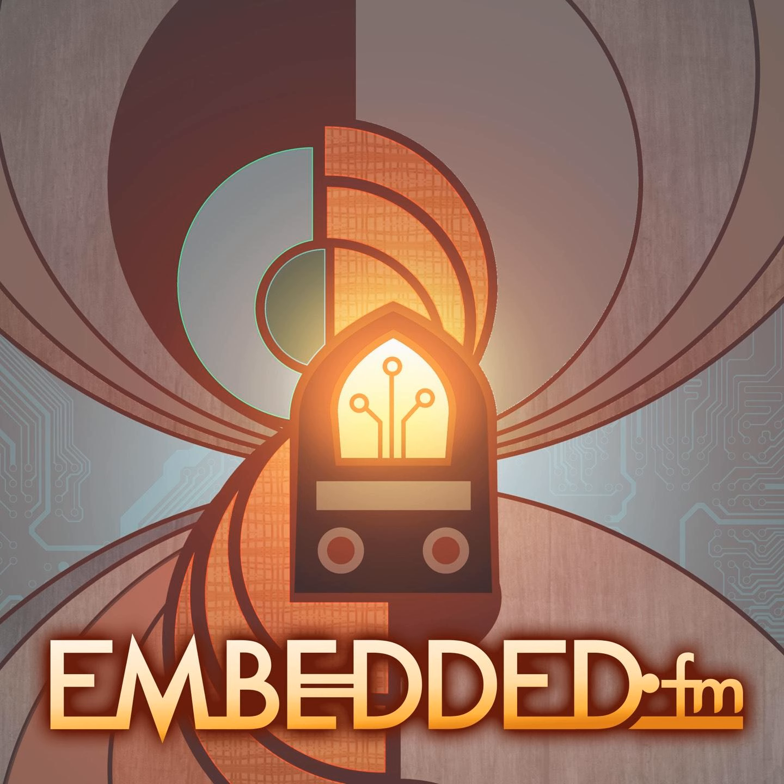And you did one for Circuit Cellar too — the Design Spark contest? Yeah, that one was much more similar to the Hackaday one, where you actually had to build and document stuff. The big requirement was that you had to use the ChipKit — the big Microchip-based development platform. When you're doing contests you've got to take your engineering hat off in some cases. The system I designed had a little GPS receiver, the ChipKit, it was solar-powered and recharged, received time from GPS, and sent it out as a broadcast message on the XBee RF module. It broadcast time, because I needed very accurate time — I wanted to build an altitude-azimuth antenna mount to track the ISS. To do that you have to know very precisely what time it is so you know where to aim the antenna. I did the time broadcast thing with the ChipKit and got it all working, but I haven't built the antenna mount yet. Well, now you have SATNOGS to look at — because that's what they did. They solved a couple of problems I conceptually had with how to build it. So I'm going to take that.